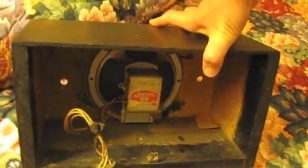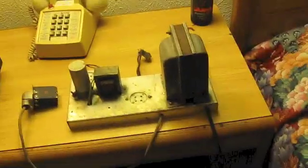I'm going to check this electrolytic and bypass it. It came with the proper connection to the BC-224, so we're going to fix this up and see how it works. We've removed this power supply from the enclosure. The speaker actually has an inductor — the inductor is the magnet, so the speaker is part of the power supply. Here's the chassis with the rectifier tube removed, and underneath it's just a piece of sheet metal that someone bent over and turned into this chassis.